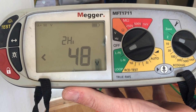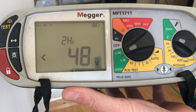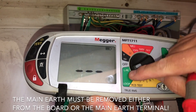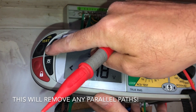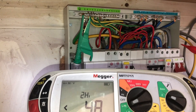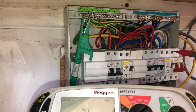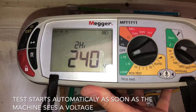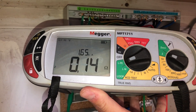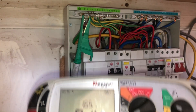The high current test makes use of a 25-amp full-function test. So I'm setting the machine on LPE, selecting the correct setting which is two-high, and I'm putting the probe on the live conductor. It's already connected to earth, and as you can see it's an automatic test — and it's displayed 0.14 ohms, which is our ZE reference.